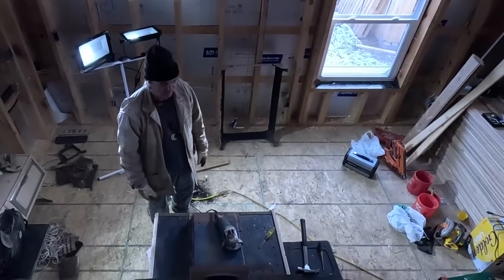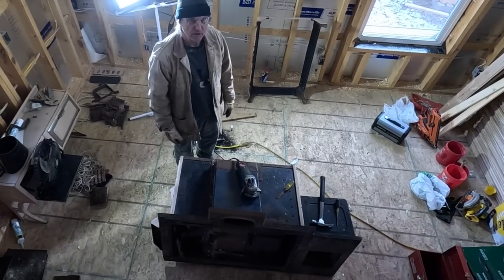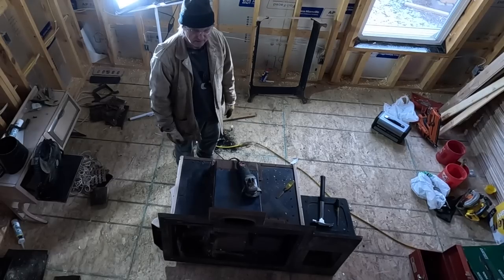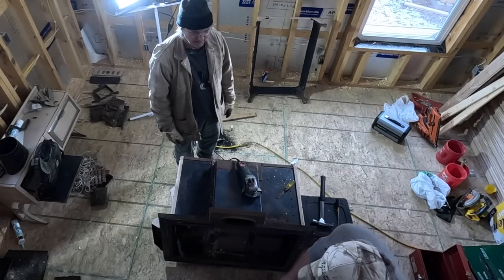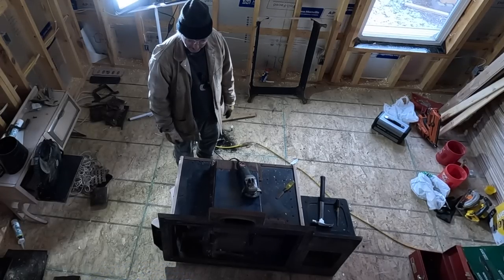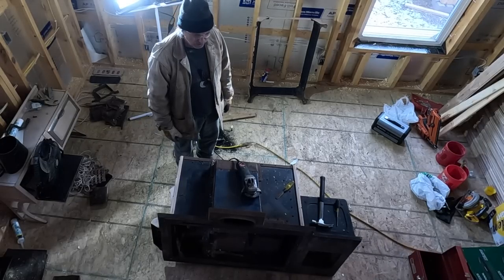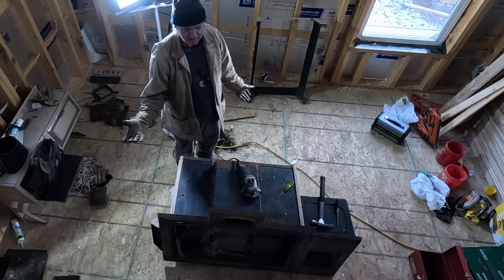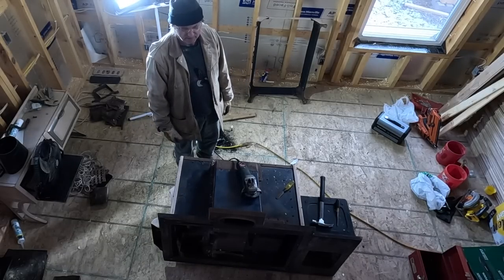Well, I think that when you get your little furnace, probably about a 35,000 BTU would be good enough for here. Somebody told me 22. Who said that? I think your son. Well, that means let it run a little longer, but I think you're going to come in here initially when it's cold out, right? Do you want to crank it up? It takes a while. Yeah, true.